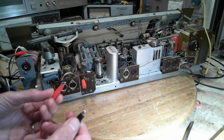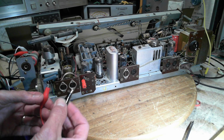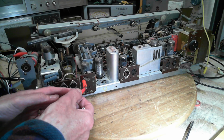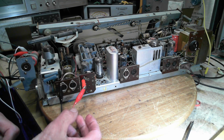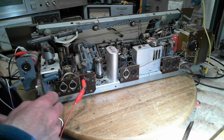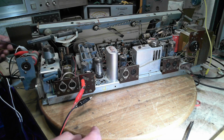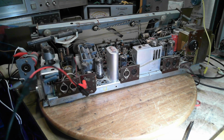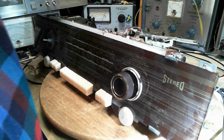Now, I always have a choice of hooking up the live wire, if you like, or the grounded wire. Usually I just start with one, see how that works out. I need to ground this. Then this ground terminal down here just goes right to the chassis, so I just have to clip this anywhere onto the chassis. If I choose to do that, this is going to an outdoor antenna. Nothing I'm terribly proud of, but it works well. A folded dipole antenna.